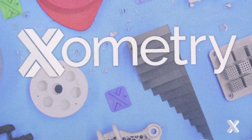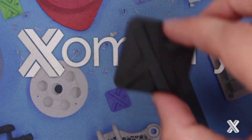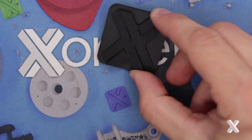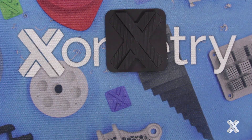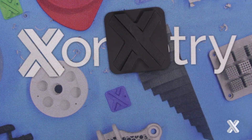To go more on the rigid side but still have that fantastic polyurethane capability, that's our RPU, our rigid polyurethane. Hanging out right at Shore 80D, this is something where if I have an ABS part or PC-ABS part, I may be using the RPU on the Carbon platform. I could get some great results from this. It's going to be one of our more popular materials because it directly substitutes for something where you may have to tool up to get the same properties, like a urethane cast or injection mold material.